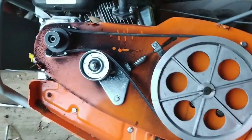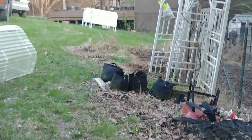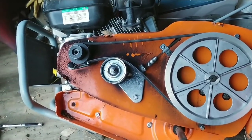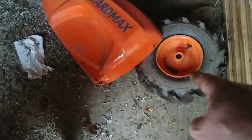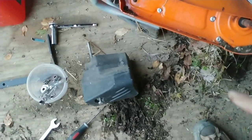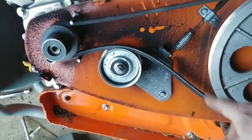It ain't one thing, it's another. The yard-max tiller broke down. Got the whole entire garden done, brought the tiller in — not very far, just came up the ramps — and it stopped pulling. Wouldn't go forward, wouldn't go reverse. So I figured I'd check the belt. To check the belt you've got to take the tire off, which is held in by a cotter pin, plus four 10-millimeter bolts and a half-inch 13-millimeter nut.